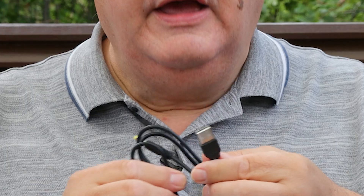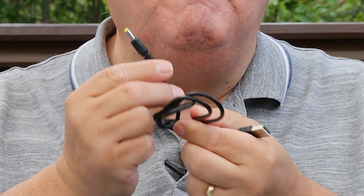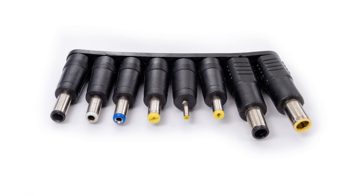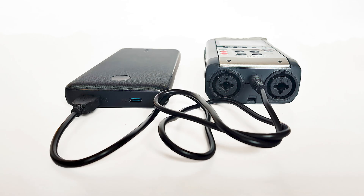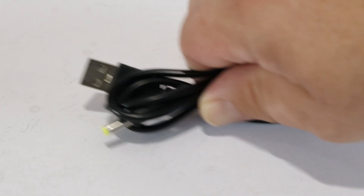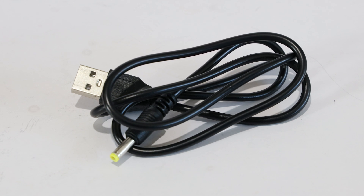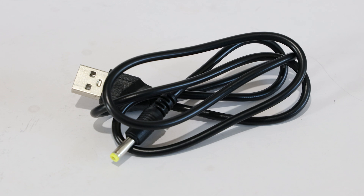To get this to work I got a USB power cable. It's got a USB connector at one end and a male DC power connector at the other. DC power connectors come in a variety of sizes and the center can be either positive or negative. To connect a Zoom H4N or H4N Pro to a power bank you need a power cable with a USB 2.0 Type-A male connector at one end and a 4.0 mm by 1.7 mm DC power connector with center polarity positive at the other. If you don't already have a suitable power cable, I'll leave a link in the description to a cable that will work with your Zoom H4N or H4N Pro.